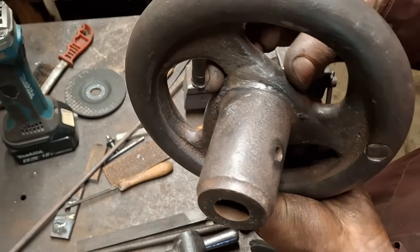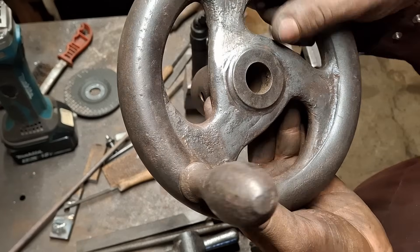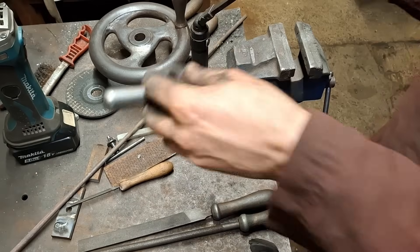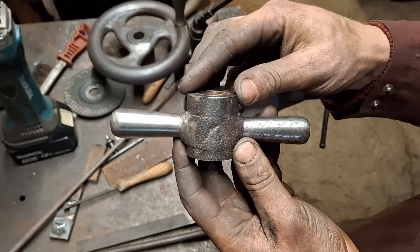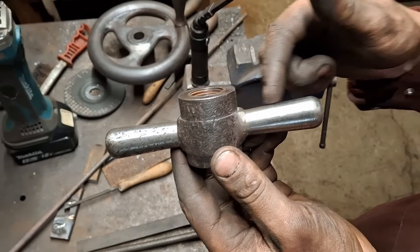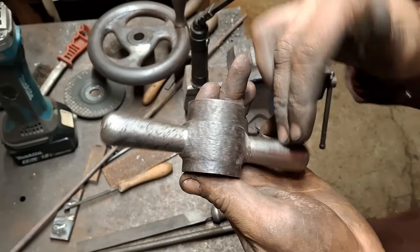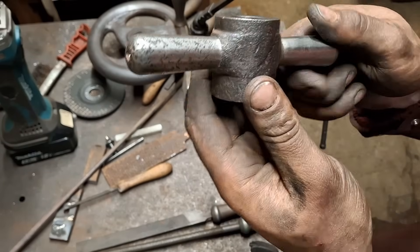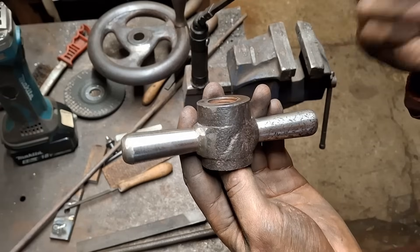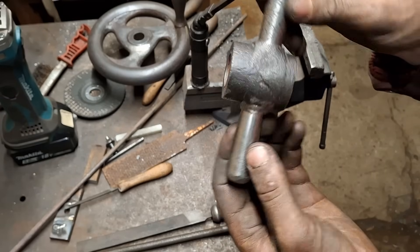Just a little bit of filing work around that spoke and around that weld, and that is ready for paint. I'm quite pleased with how that went. As for the feed engagement handle, I'm very pleased with how that came out. Obviously this is the new end, and I shined up the old end because the contrast was a little bit too glaring for me, but it will tarnish down like the rest of the castings. That's why I like to use cast iron material to add on to any parts that are also cast iron.